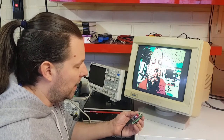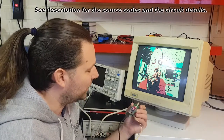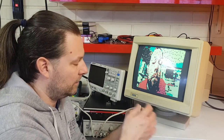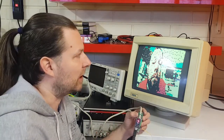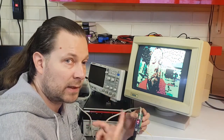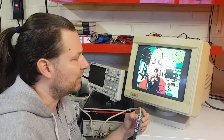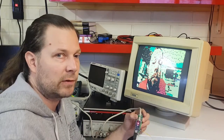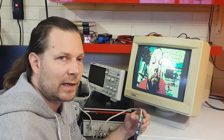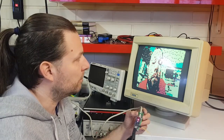input. And for that purpose, I created this prototype around the Arduino board that I had laying around. And because the Arduino itself is quite limited when it comes to VGA displays, we've only connected 2 out of 3 colors. We only have green and red at the moment. If you mix them, you get the yellow, and if you don't use any colors, then you get the black, but the resolution is still quite compromised. But that's enough for prototype purposes.